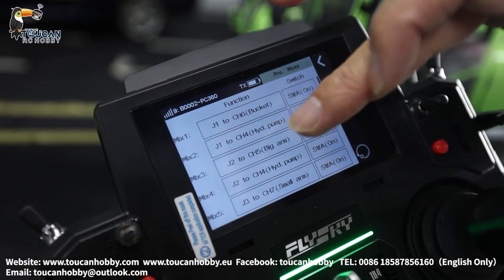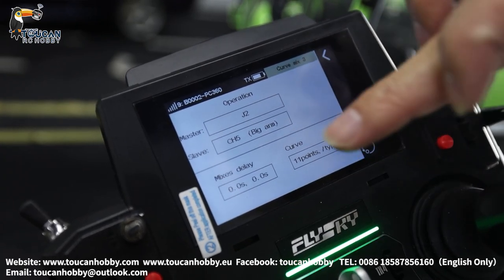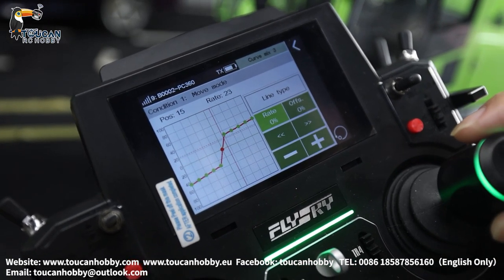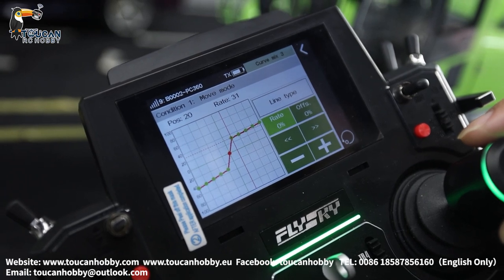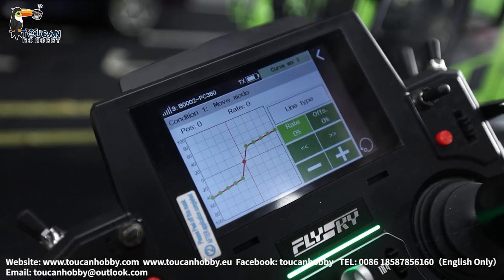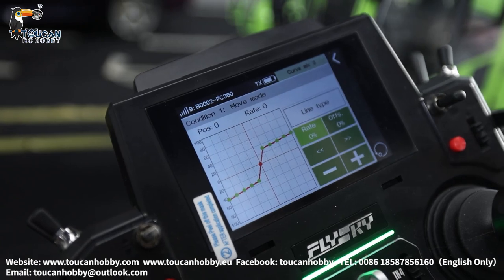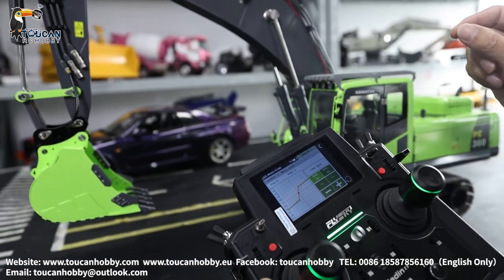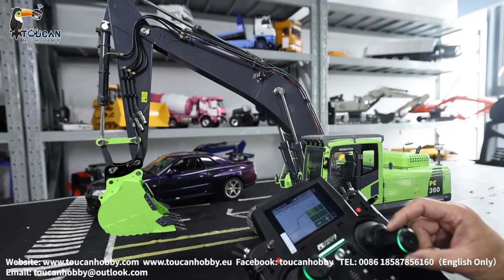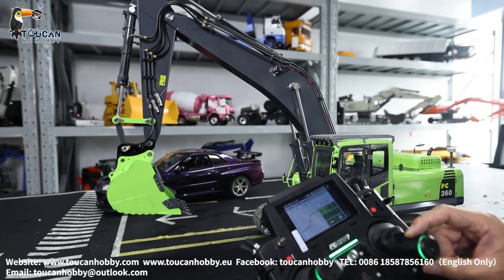So for this it's all the same. J2 and CH5 — that's the big arm — this is the controlling curve, J2 and the big arm valve. For the big arm — that's J2 — started from around 20 to 30, going up, started from 31. Different machines, different valves, even for the same one the servo could have a little difference, so you need to adjust from your side, precisely one by one. I slowed it down so it's not moving very quickly and you can control it. Maximum when going down 38%, when going up 44%.